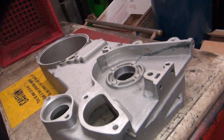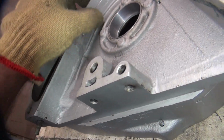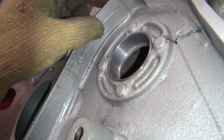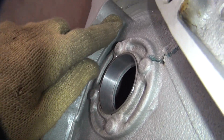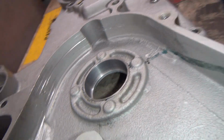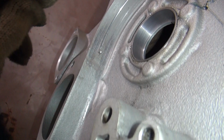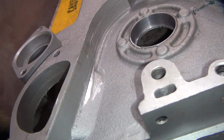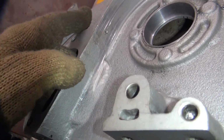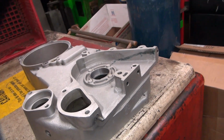All right, now the bad part of heating up a primary is you've got to let it cool off. So that takes a little bit of time. Now we bored this out for a big sprocket in here. And I'm not sure what got jammed in there, but something jammed through there. It's making more clearance. Something big. You see it got jammed in there. He dropped something in there, or something got in there, a rock or something, don't know. It's eating inside of here too, but hasn't eaten through yet. So that's a good sign. Alright, I'm going to cool this off a little bit. We'll be back.